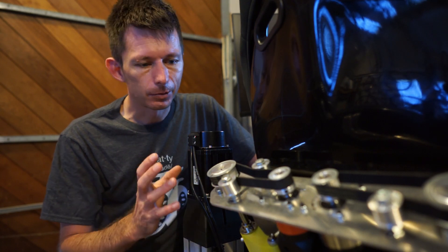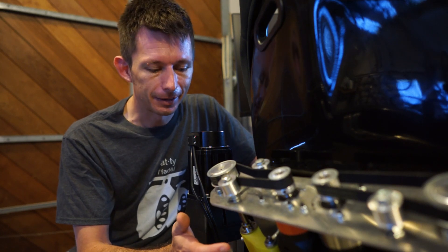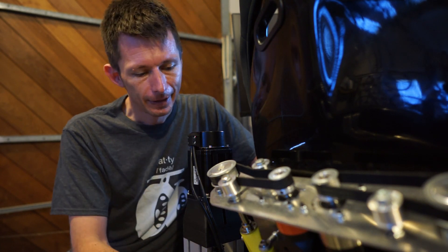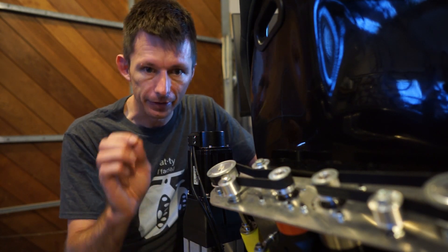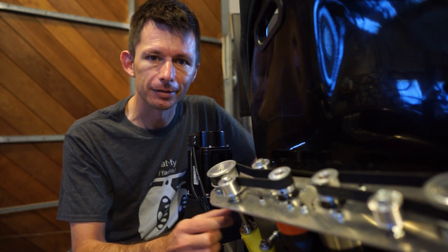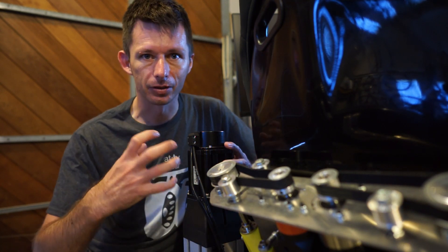That system all seems to be working functionally so far. I was expecting these to break earlier — they're just a simple 3D-printed arm, 20% infill, 4 layers, nothing fancy — and they're still holding up, which surprised me. I did make them big and chunky, and there's a through-bolt between the two push rods so it can't snap an edge off. These clamps here — don't buy them. The grub screws are terrible and it's all soft metal. I'm going to use some bigger clamps, thanks to Gary for the design, and redesign that arm. It is through-bolted just to make sure it's not going to slip relative to the arm.